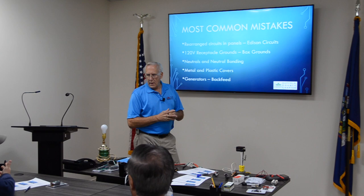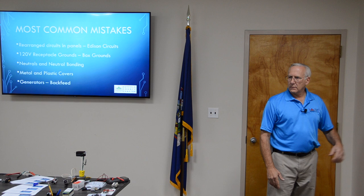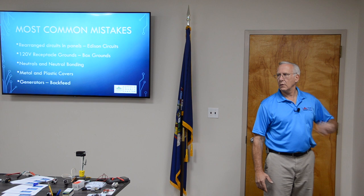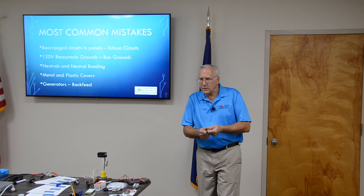Metal is a conductor. Do you want the metal cover to be energized on an insulator where you can touch it? No. Never use a metal cover on a plastic box. Never. Ever. You can use a plastic cover on a metal box because plastic is an insulator. Plastic is a dielectric. Okay, we can touch the plastic. If this is live, we can touch it.